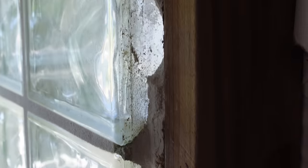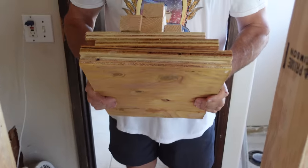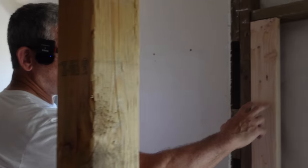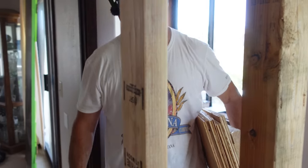That's what we're looking for — a nice clean edge for our Lexel. Dad's been cutting blocking for grab bars and the backer board. We'll put blocking here and here for our grab bar — we're going to have a vertical grab bar here and a horizontal one here. Still in board shorts from the beach this morning — but that's the vibes. Let's go.